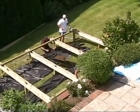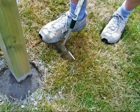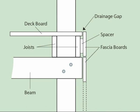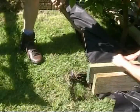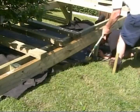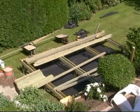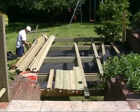Now that the support posts and beams are in position, we can continue to lay our membrane over the turf. Using an edging tool or spade, make an incision into the turf all around the outer edge of the deck area. Bear in mind that the position of this incision will be determined by the eventual position of your deck boards and fascia board, vertically above the edge of your deck. Cut lengths of the membrane to suit, and with the edging tool or spade, push the outer edge of the membrane into the incision in the turf. Continue around all of your deck, laying and fixing the membrane. Ensure that the complete area under the subframe is covered with membrane. Make cuts to the membrane to go around support posts and any other structures or deck elements within the subframe area. Overlapping patches can be made if required, and fixed into position using metal staples.